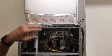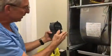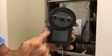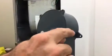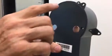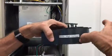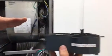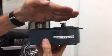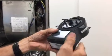Now let's talk about mounting. As you put this unit on the metal cabinet, you'll notice it has a self-sealing gasket and screws — just use small sheet metal screws and self-tap it. If you had room to mount it inside, or if you had a horizontal unit, you can mount it straight down as long as the air is flowing right across the top. Just think of it as two goalposts with airflow straight across.